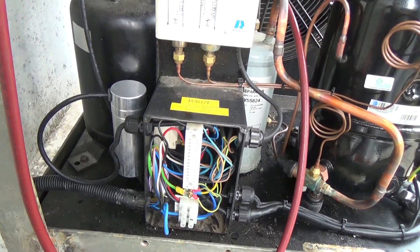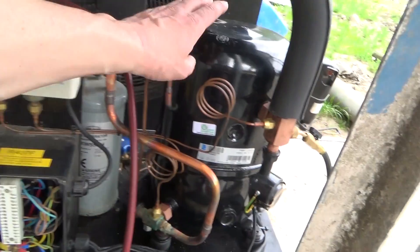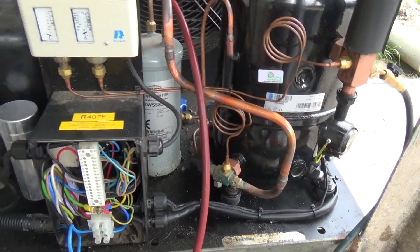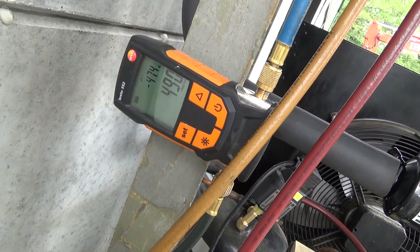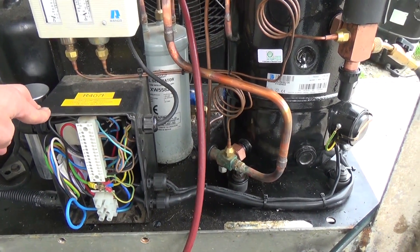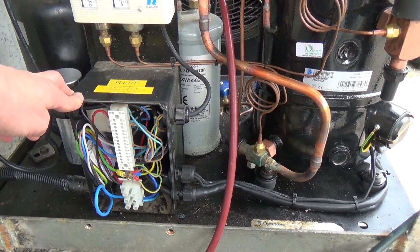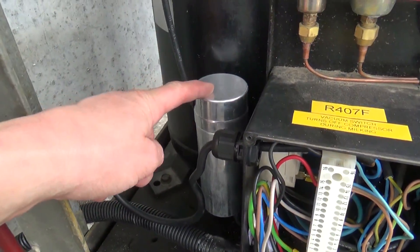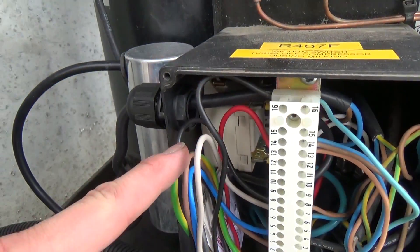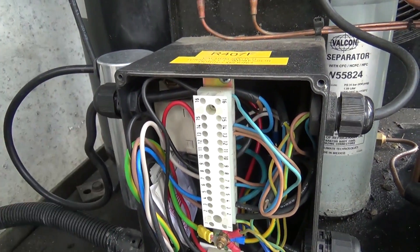I think it's good enough. It's had a good vacuum when we put it in originally, so really all we need to clean out is the compressor. It's been on there for quite a few hours — I think that's because it's an old system, probably 20 years old. I've got the run capacitor outside, start caps in the box, the relay's up there. They're all mounted the same way as it was originally — you should always mount them the same way.